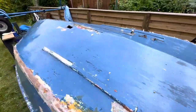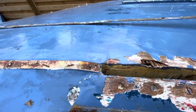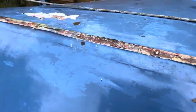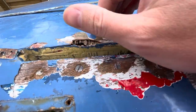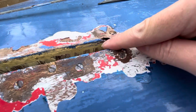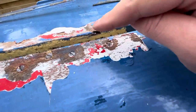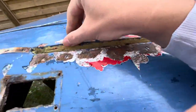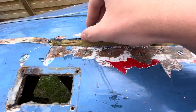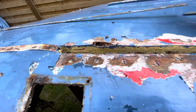That led to lots of problems. This is a common problem area for the mirror around the centreboard case and down here, and what you can see is that was never taped in or made watertight correctly, so water has just seeped into the plywood here and there's this rotten patch around there. It kind of sounds not too bad but when you dig into the interior of the plywood it's just super soft.